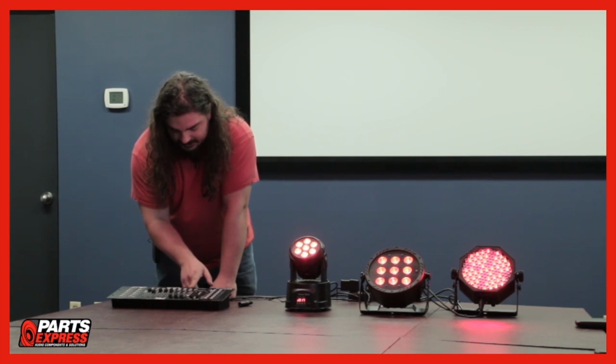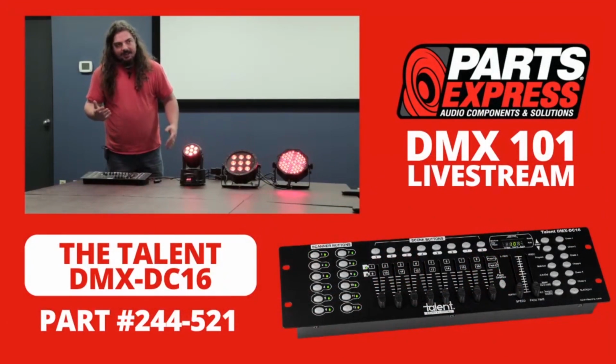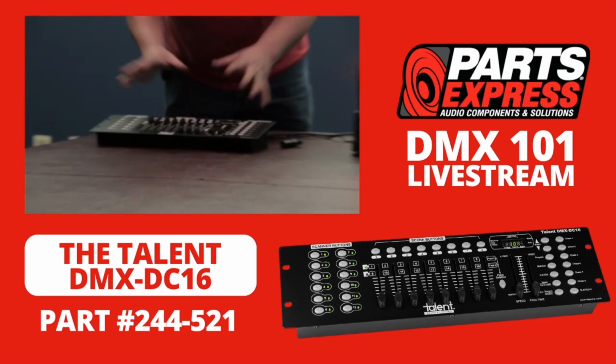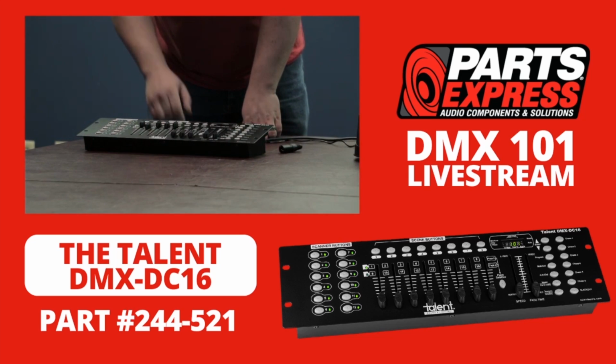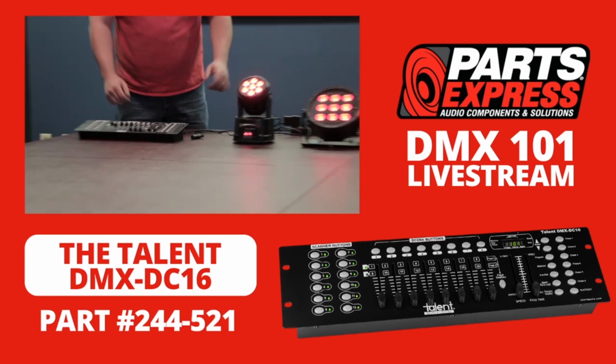Now you have 8 scenes with 30 banks of those scenes. So you can have, well, I can't do the math on that right now, but yeah, 30 banks of 8 scenes. So you've got a lot of options of how much stuff you can save. So I want to save this one to scene 1 in bank 1. I'm going to hit add and then hit the scene I want to save it to. All the lights will flash on the board letting me know it saved it. Now if I hit 2, they all go dark. If I go back to 1, now that's saved it.